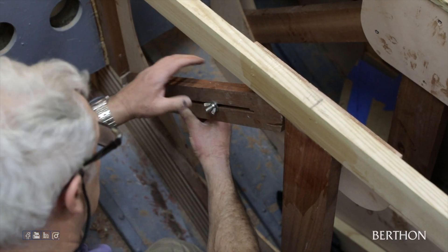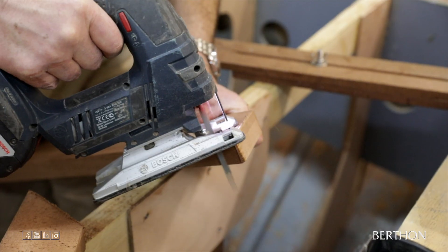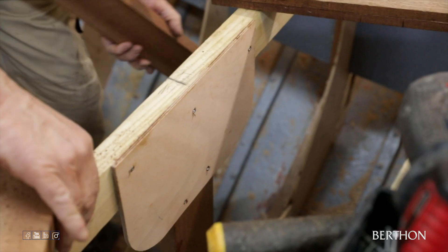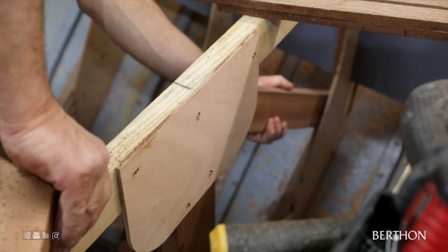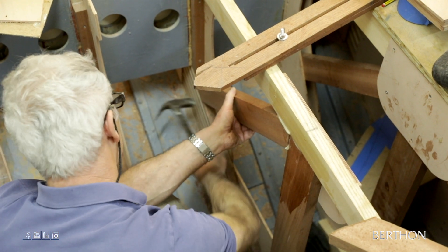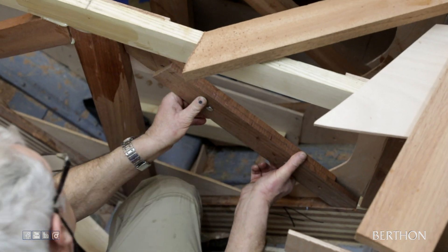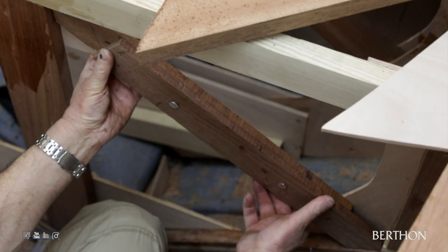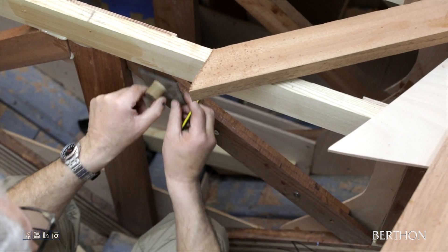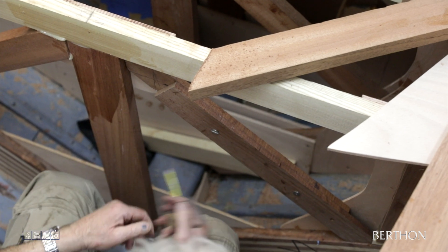I made this tool to aid marking out and cutting our diagonals, which also enabled us to get the perfect angle, eliminating any gaps that might have been created using traditional methods of measuring. This gauge is able to slide along its length to get the exact length needed, eliminating any waste that might be created by measuring incorrectly. This gauge also made it easier because we needed to keep these diagonals as close to 90 degrees to the frame as possible, as there is more strength at 90 degrees than at 45.